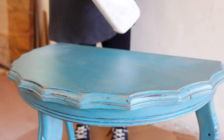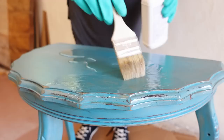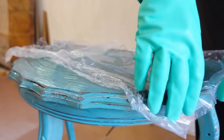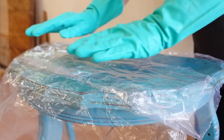Now I'm all geared up and ready to get started. I need to apply the stripper very liberally — you do not want to be shy with this at all, or else it's going to start to dry out too quickly and it won't have time to do its job. I find it's also easier to work in small sections, especially on really detailed surfaces, so that you don't have your stripper drying out on one section while you're working on another part of the furniture. This stripper says it starts working in as little as five minutes, but I'm going to cover it in a little bit of plastic and let it sit for probably 20 minutes, and then when I lift up my plastic I can see if the paint is starting to lift up as well and I'll know if I'm ready to move ahead.